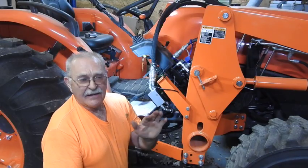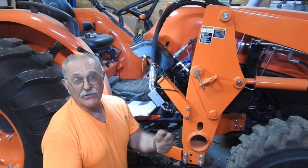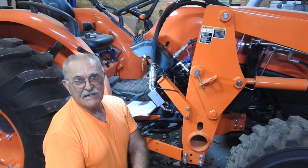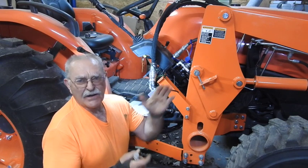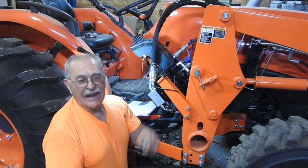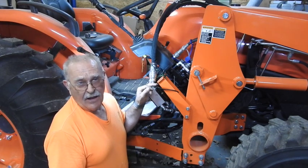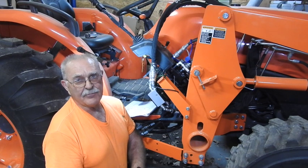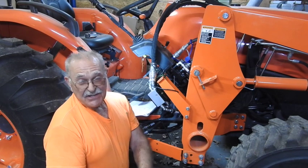I literally thought I had the issue solved. I pinched the O-ring — that's no big deal, that's my fault. But the fact that I had the ORB fitting threaded onto the male JIC with no O-ring and no specific adapter in the middle is why I had that little bit of seepage a few days later. However, it's all taken care of. The point remains: you really have to watch closely on these directions. You've got to read every one of those little notes and pay attention to every one of those arrows and numbers. What really threw me off is the fact that those JIC male and the ORB female threads are exactly the same — they bottom out, no O-ring, won't seal, and they will leak.